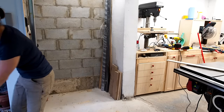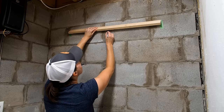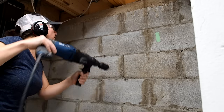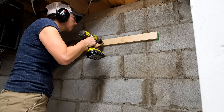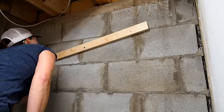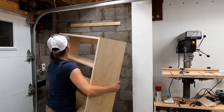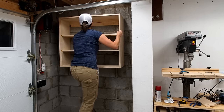Okay, let's get this thing mounted to the wall. I've got the other half of the cleat and I've pre-drilled three holes — I'll just roughly transfer the center marking onto the wall. Since I'm mounting to cinder block I decided to go with Tapcon screws, so I'm using the drill bit that comes in the package. I'm going a quarter inch deeper than the screws will go and making sure to clean out all the dust from the hole. I'll secure the first screw and level it so I can then drill the other holes. You gotta clear away all that dust. Looking solid, so it's time to get this cabinet on the wall — it's awkward and heavy, but it's all worth it once the cleat does its thing and the cabinet's hanging solid on the wall.